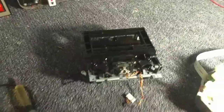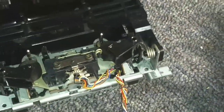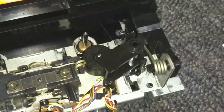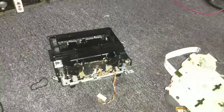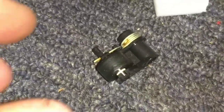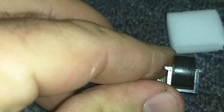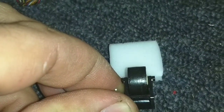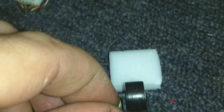Now you have to clean the pinch rollers. There are clips here at the bottom - pull back on the clip as you lift out and they just come off. This is about typical for what you'd expect from a pinch roller of this age - a little slick surface. We're going to resurface that. It's important to look at it and see that it's uniform with a nice uniform shape and a little dome at the top - that's what you want. If it's slanted in either direction, it's defective and you've got to find another one.